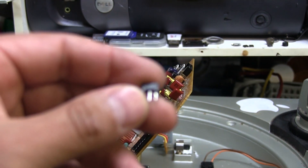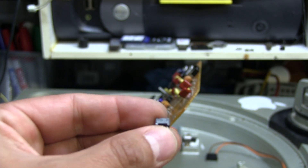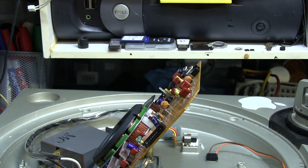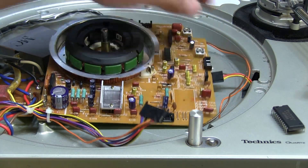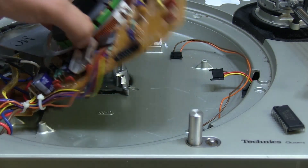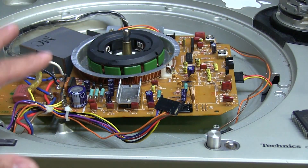This isn't actually the original transistor. The original transistor was this little one here numbered 2SD637. This one is dead — it actually has two tiny holes right above the numbers, so it was completely destroyed. It was an NPN transistor and I think it might actually be a discontinued part because I couldn't find any replacements. But I did have another NPN transistor from my junk bin that I replaced it with and put in place.